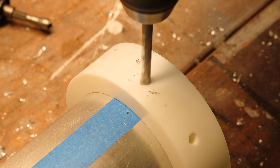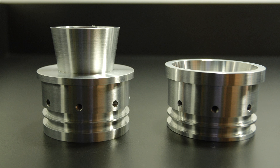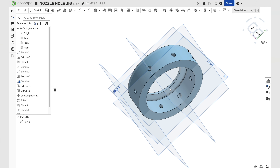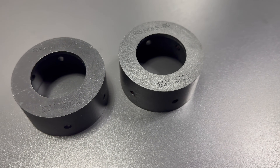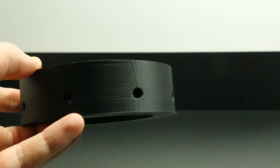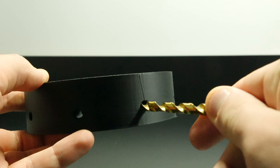This is where I need to drill the radial bolt holes through the casing, so the threads tie the casing into both the bulkhead and nozzle. This step is especially difficult because the holes for the bulkhead and nozzle are already drilled and threaded, meaning every hole in the casing has to line up perfectly. To do that, I need to design a jig that would allow me to drill the holes accurately and consistently. In the past I've had these jigs professionally made on expensive machines, but since I recently got a 3D printer, I decided to try to make them myself. That turned out way harder than expected — I ended up printing over 25 jigs. The biggest issue was getting the holes on the jig to be perfectly circular; on many early prints, the holes partially collapsed during printing and turned into ovals, which wouldn't allow the correct size drill bit to pass through.